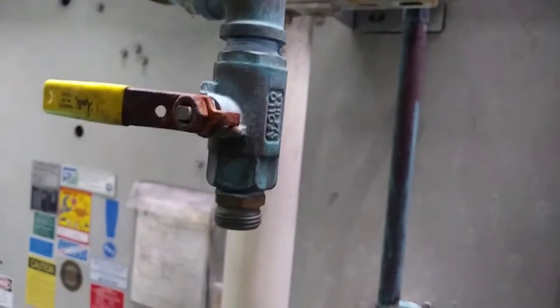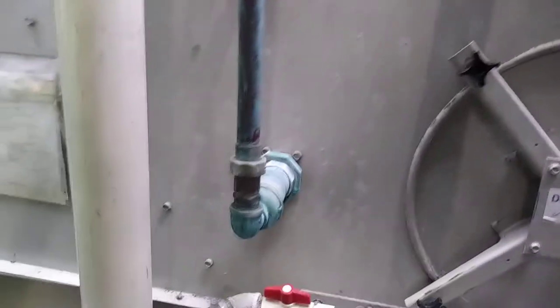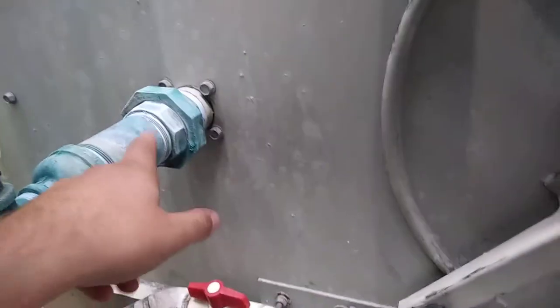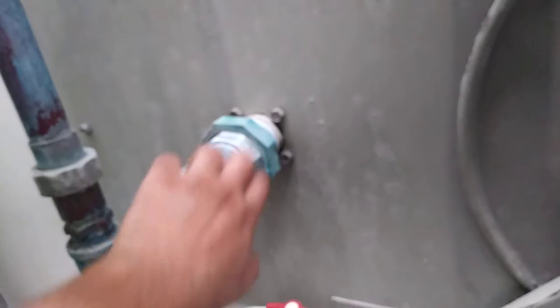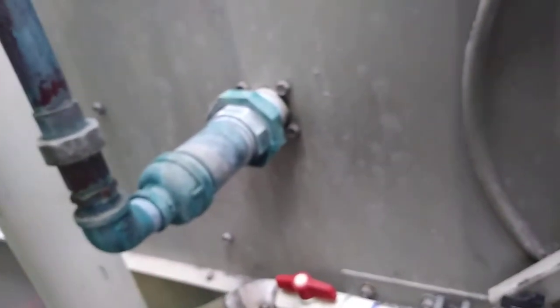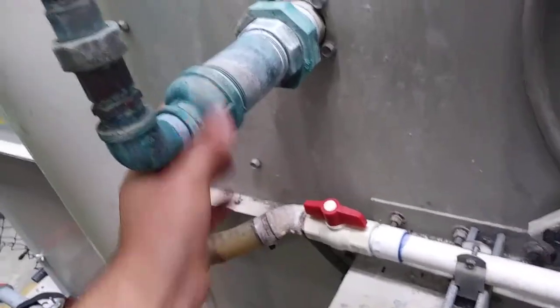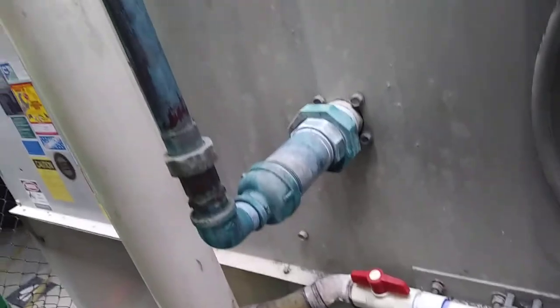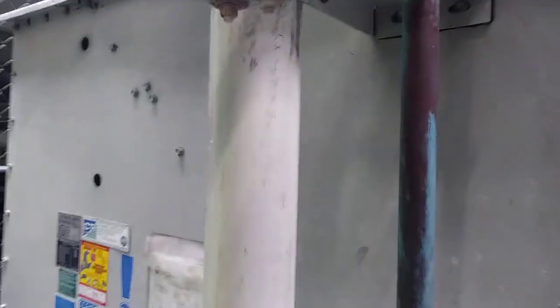There's a nice ball valve there for general purposes, a water hammer arrestor, and then the flow valve. This assembly of unions is for the steel connection to the tower — I don't believe it's stainless, so I wanted to make sure I got six inches of brass in there. I could have done that with different fittings but that's just what they had at the hardware store — maybe a little wasteful. All this stuff has obviously been here a few years now. There's a little support bracket I added after the fact when I saw how much it moved around — the hanger alone wasn't enough.